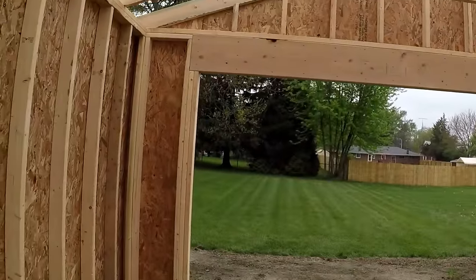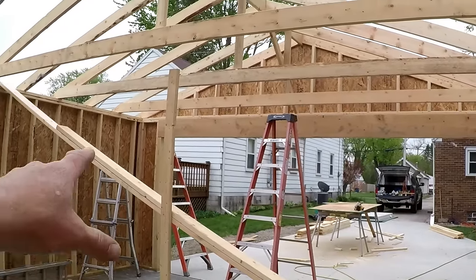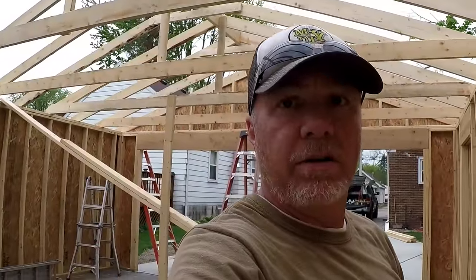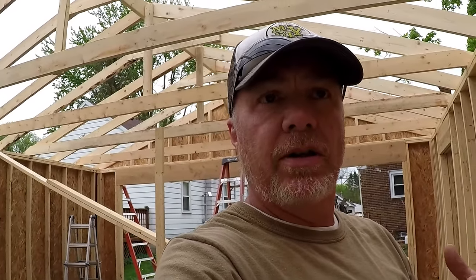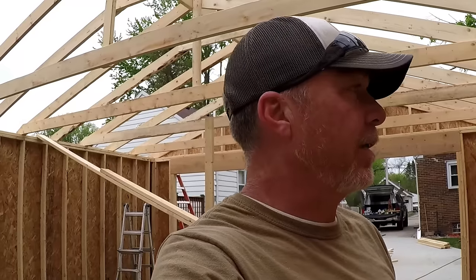I think up next I'm just gonna go ahead and get the 2x6 door trim on for the back door and the front door, and then maybe sawzall my windows and my door and kind of do that as the last stuff of the day. Then all I've got to do tomorrow is get the OSB on, get all the fascias on, which is the bracing, so the bracing will come down. And then if I care to, I will set the windows and the door. I may be siding this one, so I might wait to do that and run all of the house wrap first, and then cut out and then install the door and the windows over that. If you guys understand what I'm talking about, to me, it seems to make it easier in a more weatherproof way of doing it.